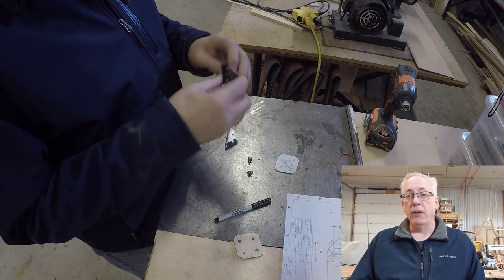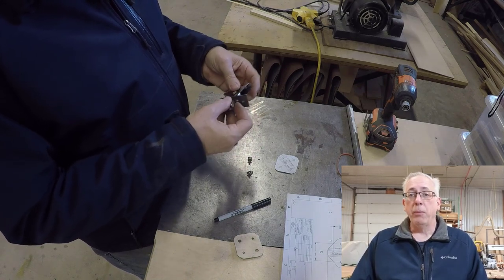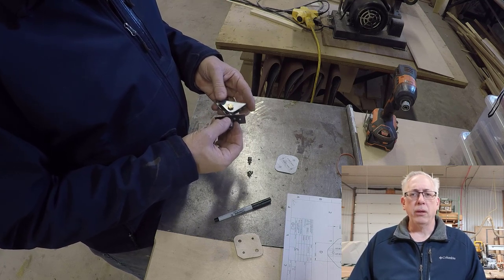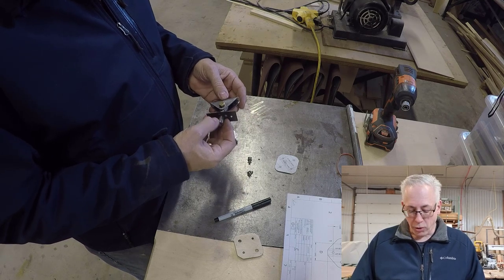It gives you a lot of flexibility and adjustment, and it's a nice bearing surface. You're not doing two brackets and a bolt kind of thing, where you're actually using a rod end bearing for the surface, which is by far the best way to approach that.